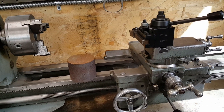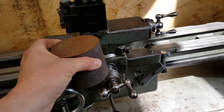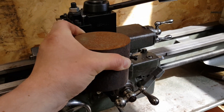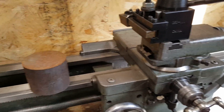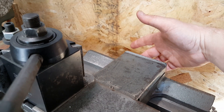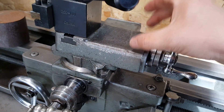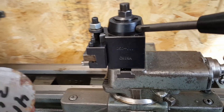Today I'm going to start machining the parts for the CNC conversion. I'm going to take this three-and-a-quarter-inch diameter piece of 4150 and machine it to replace the cross slide. The tool post will mount to it, sitting on the original Atlas post with set screws to lock it in place. I'll machine a flat on the side to mount the bracket carrying the ball nut for the CNC X-axis. There will be a plate mounted at the back using the two existing bolts where the taper attachment mounts, with the stepper motor attached to the back of it. The ball screw will feed through to a ball nut attached to the side. I need to leave the lathe intact long enough to turn this piece up.